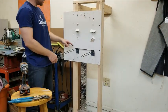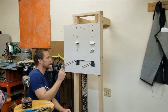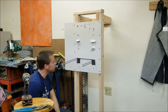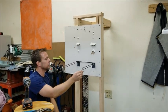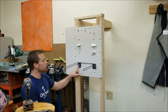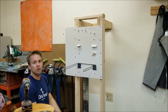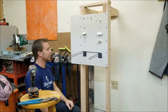And again, guys, those toggle bolts didn't fail at all. What actually happened is I started deforming my bracket. I don't know if you can see that in the video, but I actually bent this back plate, which kind of sucks. I'll have to fix that because this is actually a finished product that will never, ever have that. So toggle bolts, 12-inch lever, 24 pounds. Nothing wrong with the toggle at all. My bracket started failing.